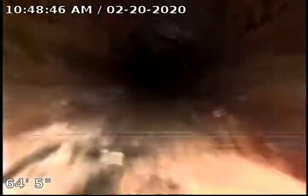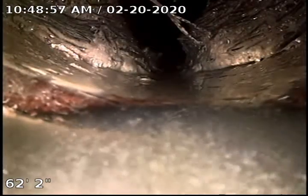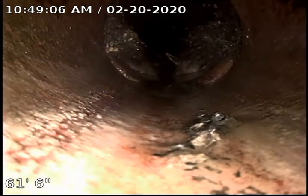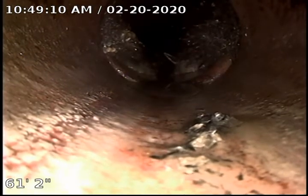Couldn't really see a lot of it coming down because I had so much water running to help me get the camera down. But I do know that we've got a few spots like this one where we have some roots. You can see that they are impeding the flow line. The camera actually bored its way through that joint right there. Back up, you can see those roots there — all right in the bottom. They're beginning to impede the flow of the waste and the water, and will become a problem eventually.